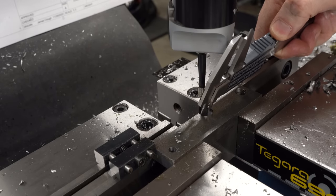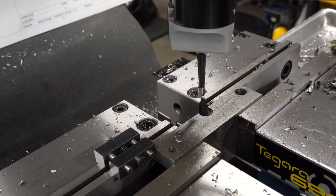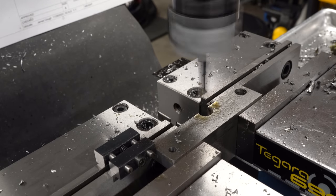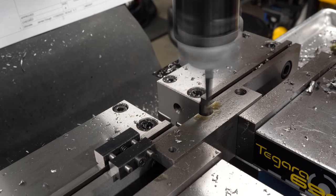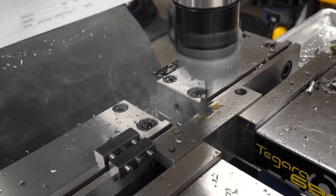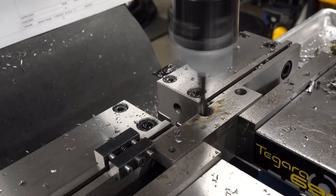I'll start measuring with calipers - no reason to get too excited about precision yet because we're at 0.510 and we're going to 0.625. I'll dial in a 10 thousandths cut, which adds 20 thousandths to the size of the hole. We'll kick in the power down feed and let it go. That sounds great - no reason to be concerned. I'm not in a big hurry, so I'll just dial 10 thou at a time, 20 thou off the diameter, and let it run.